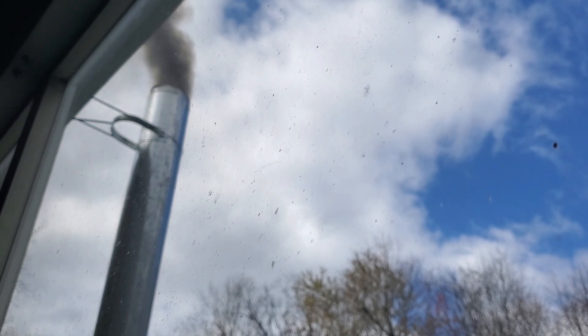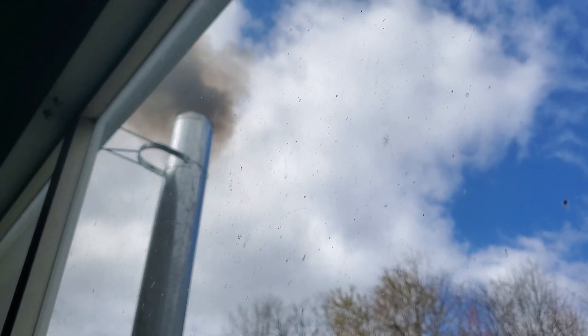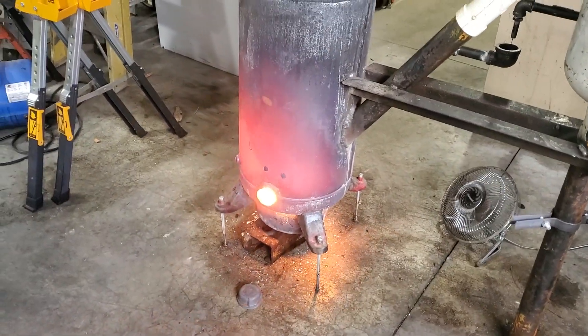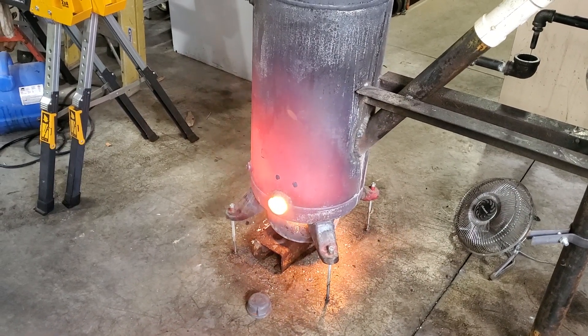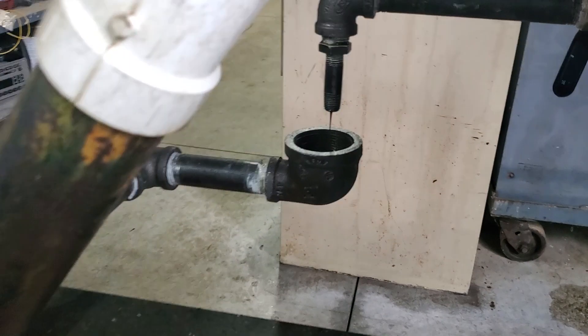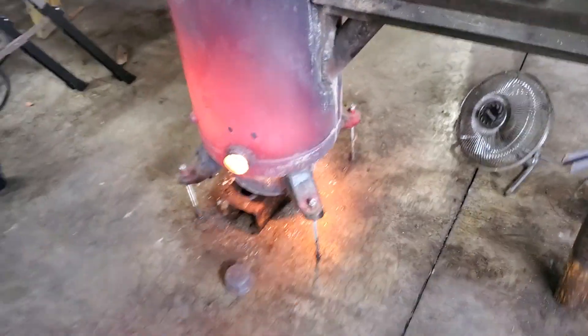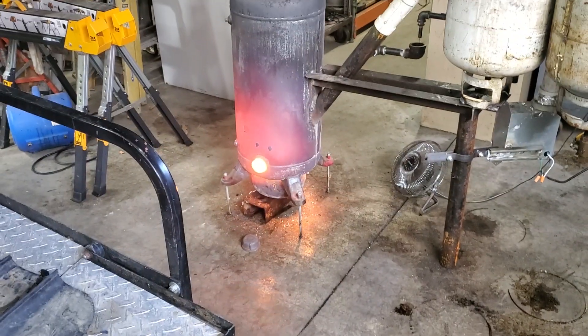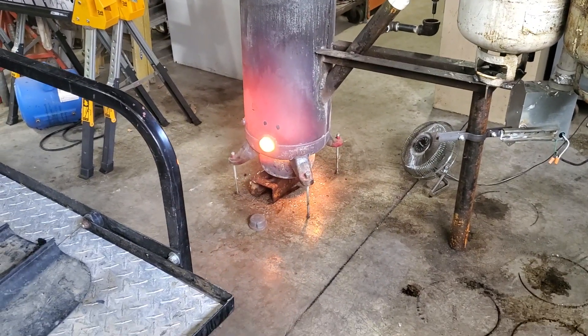You kind of have to get used to your unit — all the units are different. Right now it's trying to burn off excess oil. Obviously that's way too hot for my garage, but I've got it throttled down. I've got really less oil going in there, so I probably had a little bit more of a buildup in my burn bowl than I wanted.